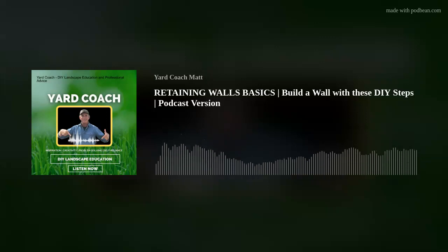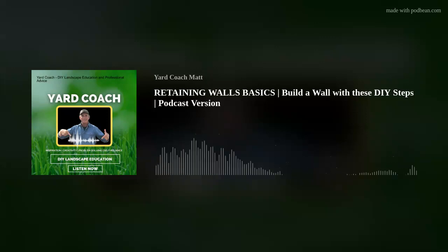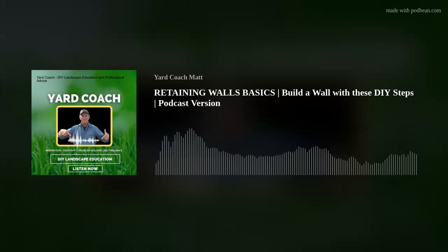Don't get impatient. Be very patient, because once you get this first layer done, you're 90% at home, believe it or not. So, stretching out from this midpoint, we're going to level each block, block to block, front to back, side to side. Once it is all set, you're just going to leave it. Leave it overnight. Come back with the level next morning.